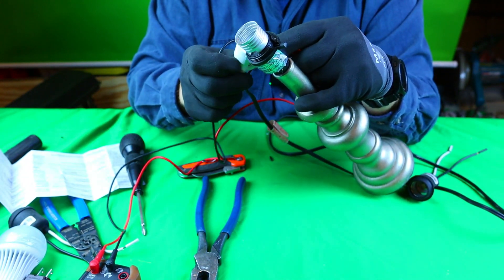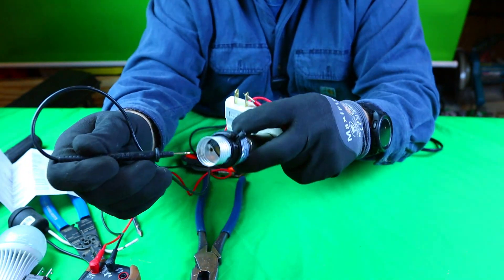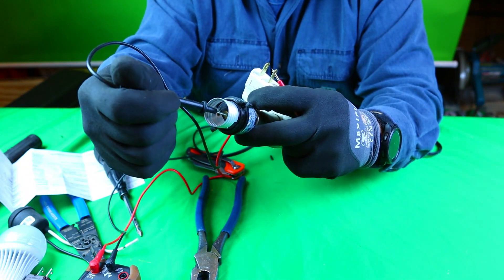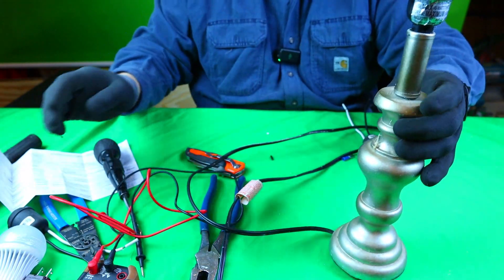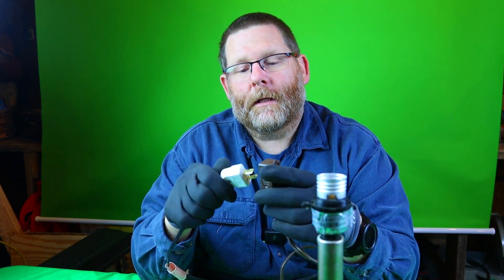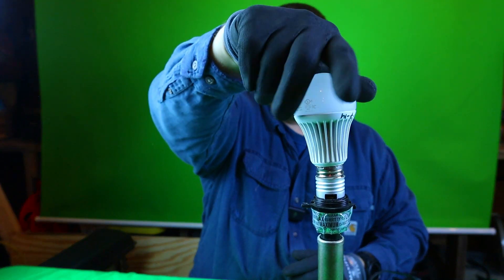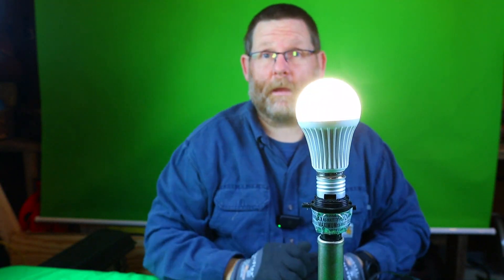We'll make sure on the hot — we'll flip it over and put it on the non-polarized side. We'll make sure. We know that no wires are touching. Switch is off. Switch is on — and it works. Perfect. Now let's give the old plug in and see what happens. We're going to take our polarized plug we just put on and put it into the receptacle part of this extension cord. We're going to see if it's hot. It only goes one way, right? Let's put it in. We're going to put the bulb in. And we have power, guys. We know that everything is wired up correctly. We know that if we touch this, we're not going to get shocked, because we made sure that the neutral was on the polarized part of the plug. And that's all you do — you are safe and ready to go.